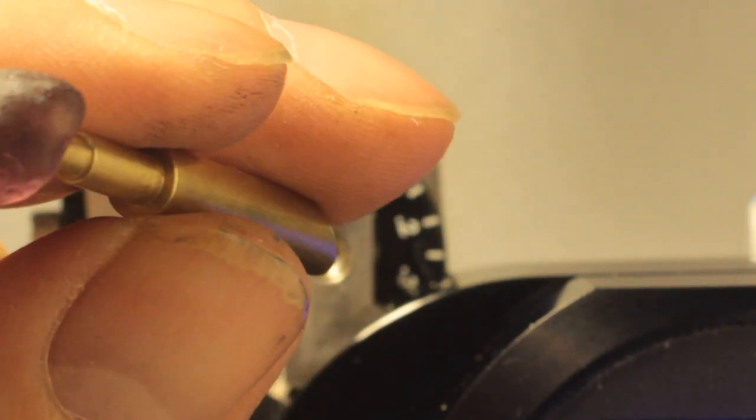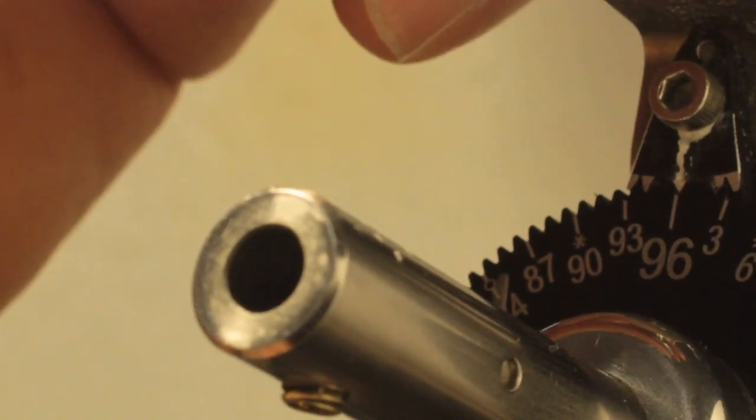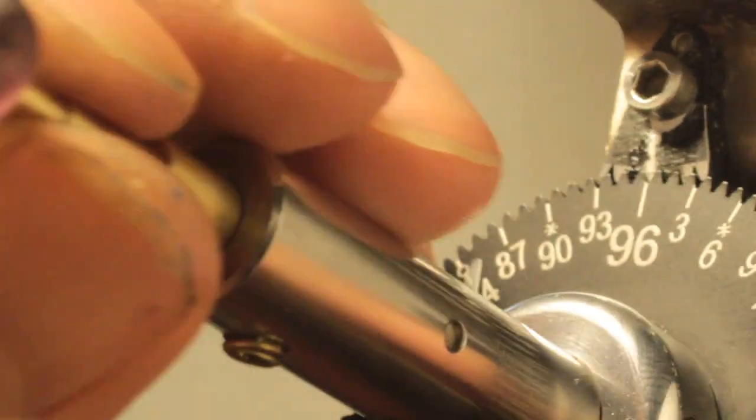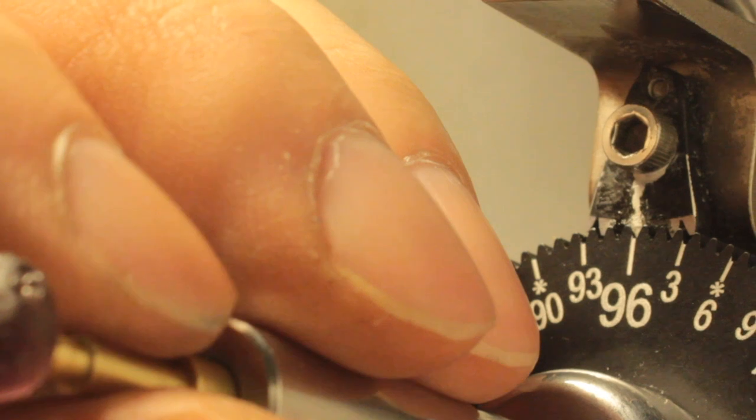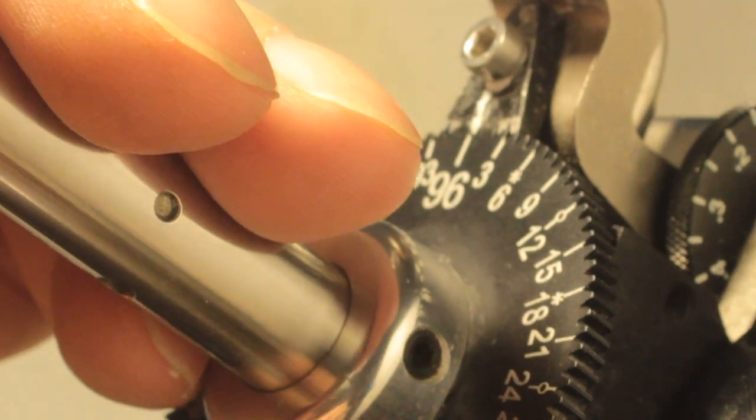To set the stone in the index of our Ultratech, we want it to be like so, with the longest part horizontal, and the 96 index and the 48. So we set the index tooth of our Ultratech at 96, set the stone in, and set it so it's horizontal like that. Now, this is a keyed dop. Ultratechs are keyed dop, so it doesn't want to go in that way. It wants to go in and set with the key, which would be not quite the way we want it, but it's no problem. All you do is just turn it to where you want it and then tighten up the set screw. So the key dop feature can be instantly overridden. It's not a big deal. So that's the way we're going to start our rainbow for our Mahenge garnet.